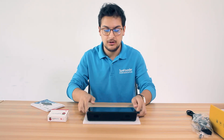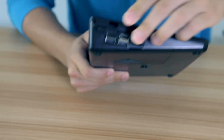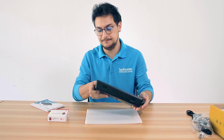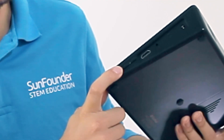Okay, let's turn it on. First of all, we need to move this little USB cable and connect it to your Raspberry Pi — this is just to enable the touchscreen of the Raspad. Then on this side you can find three buttons. Just click the first one and hold for three seconds to turn it on.